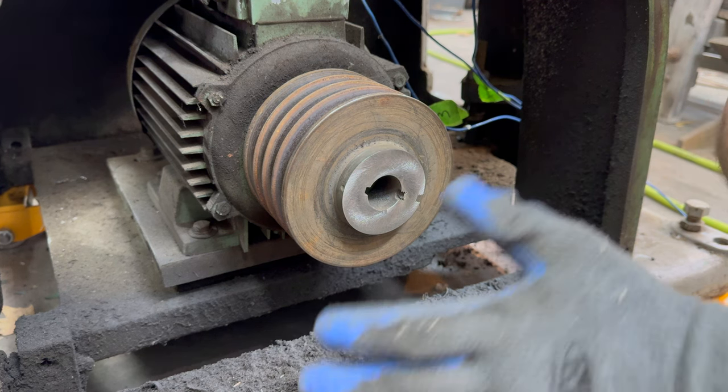I had some rubber that was a bit thicker than what was on there, and I cut that to size. Scrubbed it with Scotch-Brite and mineral spirits to clean it up. Then drilled and put in some pop rivets to secure it to the metal shroud. The fit and finish is quite good, and I'm very happy with how it fits back on the lathe. And then, to nobody's surprise, back to more stripping.